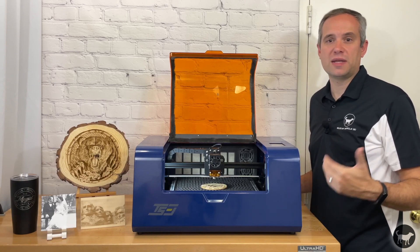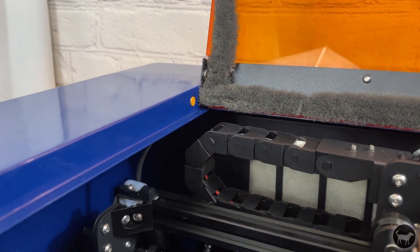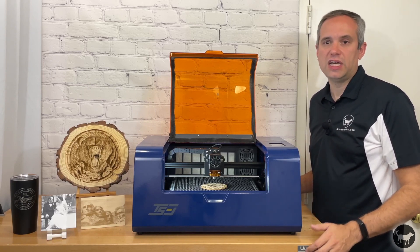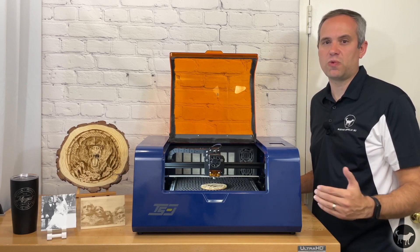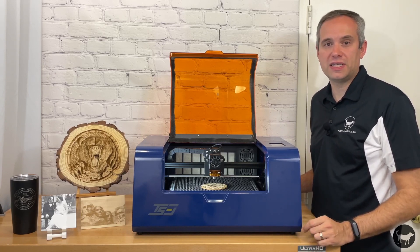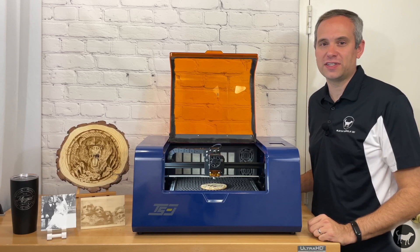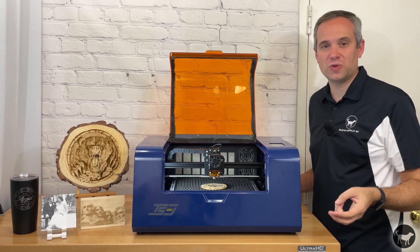You really want to protect your eyes and make sure you don't do permanent damage to your sight. Another cool thing about the shield is that it has a sensor that can tell the machine whether the shield is up or down. If you are engraving directly from the SD card the laser will stop as soon as the door is open and only resume when you tell it to. If you are burning directly from a computer using USB the laser will not stop when you open the door, so it's another reason I like working without computers hooked up to this machine. I wanted to thank TwoTrees for providing me this laser for review purposes and I can't wait to see what they do with this machine in the future. If you like this video please hit that like button and consider subscribing for more videos on laser engravers, 3D printers, CNC machines, injection molding, and all things maker. Thanks for watching, stay safe, and we'll see you next time.